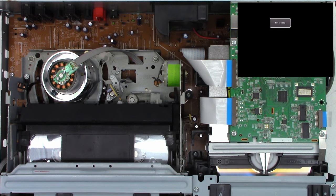Checking the pad on this one, a 470, and it reads 0.12. I'm okay with that on a 470. Checking the pad, and I am seeing 0.19, and I'm seeing that on the capacitor too. Oh, I bumped it. Now the pad reads open.